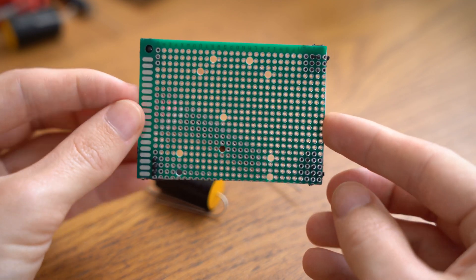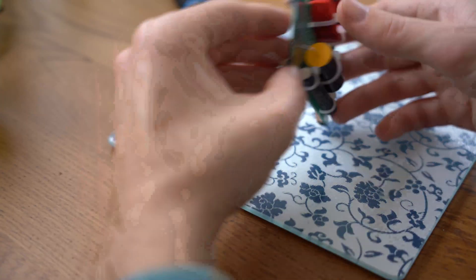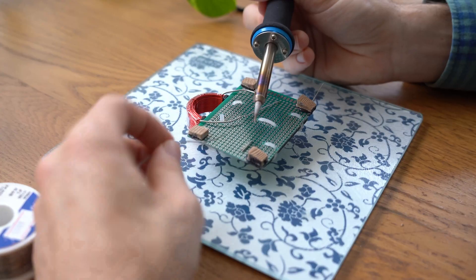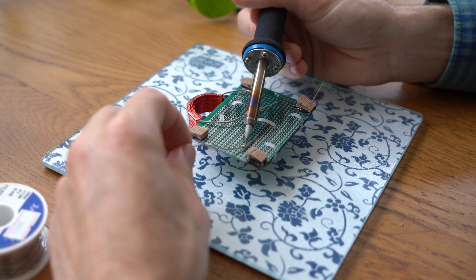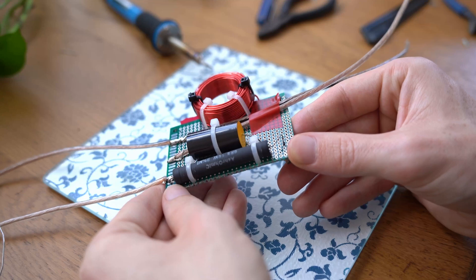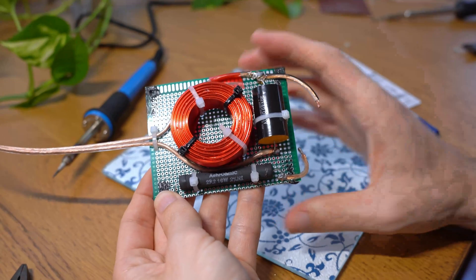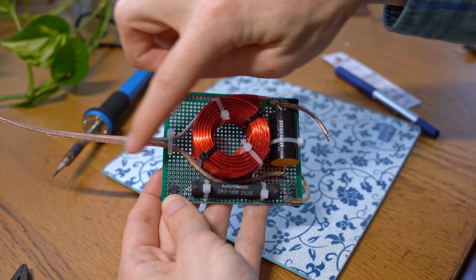All components are soldered to custom-sized PCB boards with pre-drilled holes and glued-on standoffs. On the bottom of the PCB board, I glued on some standoffs which matched the shape of the speaker for better bonding. Before soldering, all the components were fastened with cable ties. I double-checked multiple times that the layout matched the electrical diagram for the high-pass filter. I also attached the speaker wire for the internal wiring. The input signals are the two cables on the left side, while the speaker output is on the right side. The same process was repeated for the low-pass filter, with the input from the right side and the speaker output cable on the left.